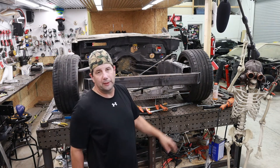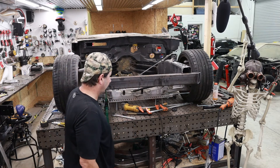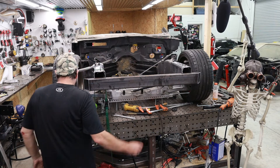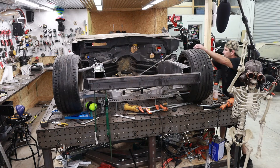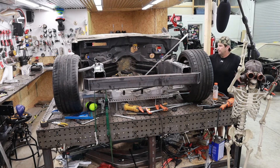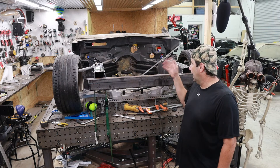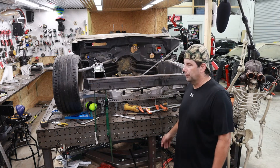I've got a new front bumper on — I'm pretty excited about that, it looks pretty good. The frame was a little tweaked; I was able to strap it down and get it perfectly leveled before I welded this on. It's leveled within 0.03 degrees and about 2/16ths out right here, so that's plenty good enough. I have decided I am going to salvage these frame rails and this cradle section — top and bottom. To do that, I had to get the car perfectly level at the right ride height, then I'll put a framing square perfectly square to the ground, strike it across the frame rail, and cut it perfectly level to the ground, which I'll use as a starting point to connect the frame rails to the front and back.